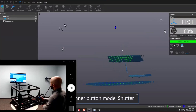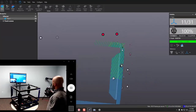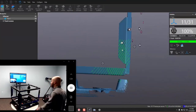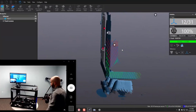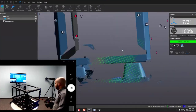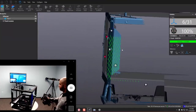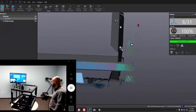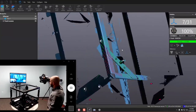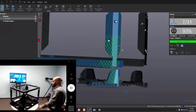Once we have this set up, I can just start the scanning process. I'm going to tweak some stuff — I'll increase the shutter speed on the camera to deal with a darker part. But as you can see, it's a very visual, almost spray-painting process. I'm just going to go across any areas of the part that I wish to scan. I can scan the whole thing or just part of it. I can even have the part move on the lazy Susan because the scanner system is none the wiser if I'm moving the scanner or the part is moving. The point is the targeting system is not moving relative to the part. This flexible targeting system is a very common theme across all Creaform pieces of equipment — it allows for very portable, flexible setups where parts don't have to be bolted down, which really increases ease of use.